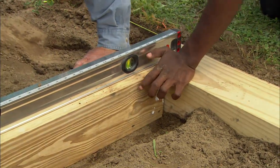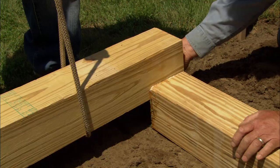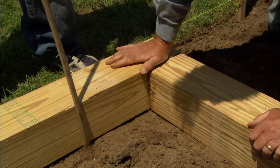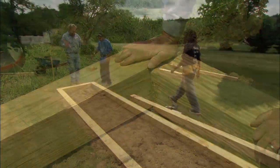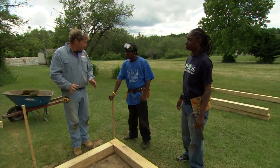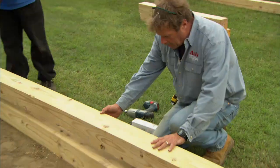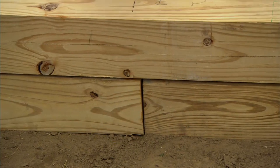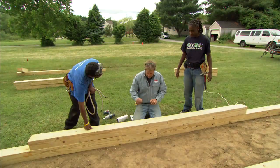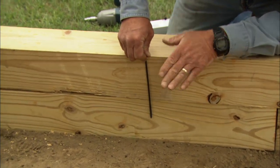We're ready to slide another piece down the side — come right flush. Slide it right down in place. That's pretty good. Now we'll just level it, re-rod it in place. We spent a lot of time on the base getting it level and square because we're going to build everything else on top of it. It's all about spanning the joints — we're going to put this 12-footer on and line the middle of it right with this joint. We'll use these timber screws and drive them down to lock the top piece into the bottom layer.